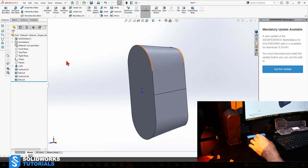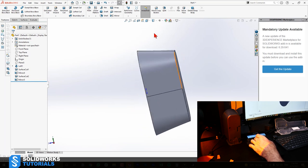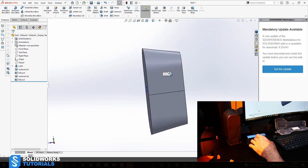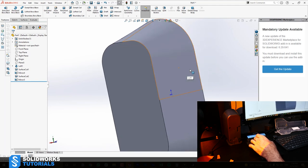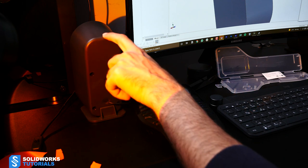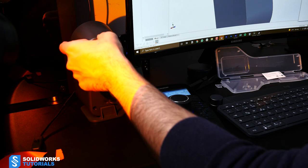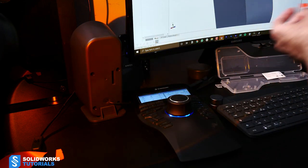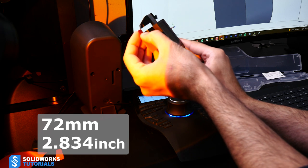The fact that I can use my planes immediately to mirror my component is because I set every sketch from the beginning on the center of my canvas — the coordinate point was in the middle of my sketch. I could go and add way more guide curves to get a very homogeneous surface, but I decided to do it this way. Now we have some rounded edges over here. Using the same trick — a piece of paper — the arc length is 72.